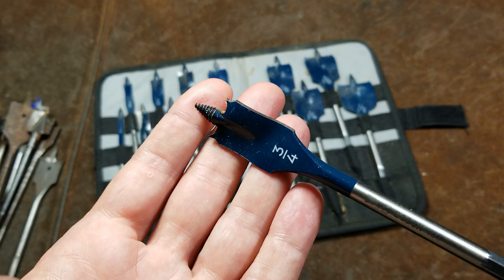I have my cube of Douglas fir here. Let's go ahead and do the first hole at 1,000 RPM. You can hear that's actually pretty fast and pretty aggressive. I'm using my DEWALT DWD 112 at 2,500 RPM — it's 8 amps — but it's surprising how aggressive these are. I think it will get through, but I'm not entirely sure.